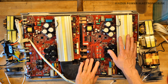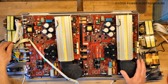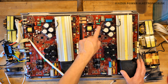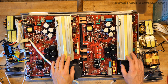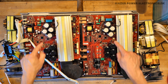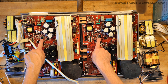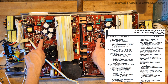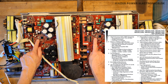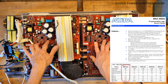Before tearing out one of the inverter boards, let's get an overview. We have the DC plus and minus running on a bus over here — DC plus, DC minus — supplying the two inverter boards. We have heatsink tunnels, switches sitting on each side, and two separate electrolytic DC bus capacitor banks. We have a single controller, which is a TMS — probably a Texas Instruments 320-series microcontroller — with a 10 MHz crystal sitting next to it, and two Altera FPGAs.